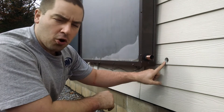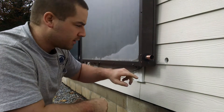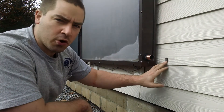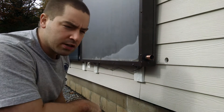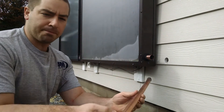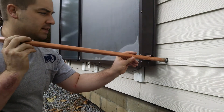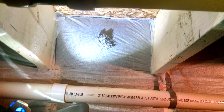I just drilled this hole and it's at a slight pitch compared to this output, so what we're going to do now is plumb that up. This rim joist cavity of the house is packed with cellulose insulation — sometimes people think that's difficult to work with, but I actually think it's fairly easy. I took this three-quarter inch copper pipe, taped off the end, and now I can pass this through the rim joist and into that cellulose, just tapping it and getting it out of the way.